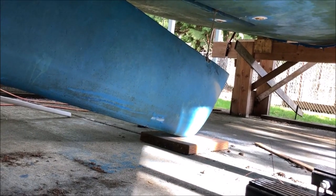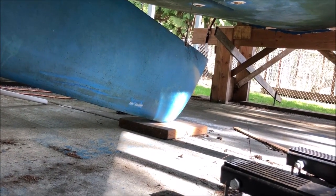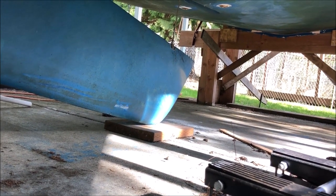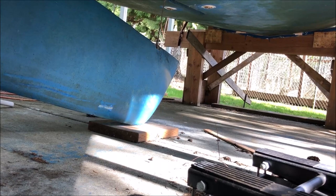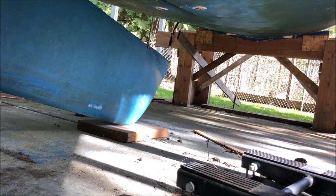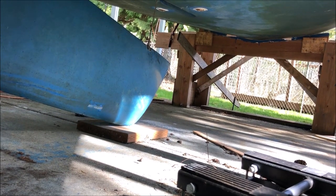My first tip is to put the keel down on the ground before you change the bolts. It weighs 500 pounds, and this way the bolts are only holding up 250 pounds of that. In my case, I bring the boat home in October and jack it up in the air on stands, and I have plenty of room to work under it. It's just a lot easier than if you're trying to do this on a trailer.